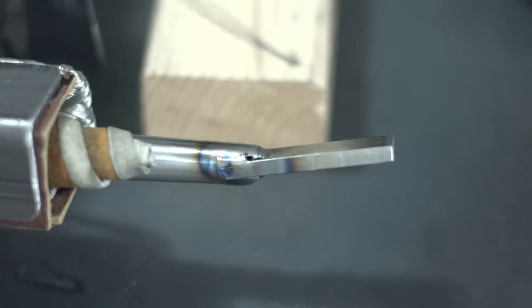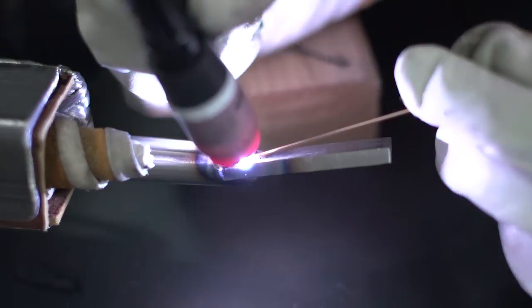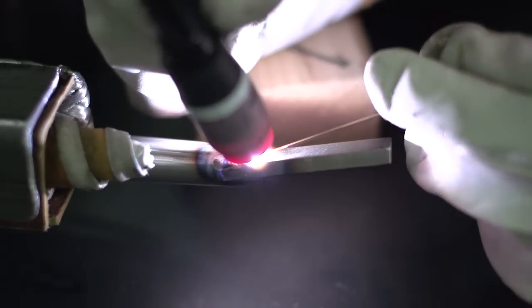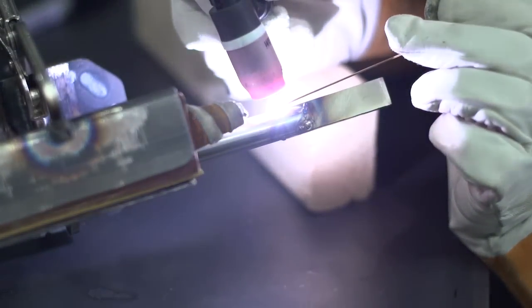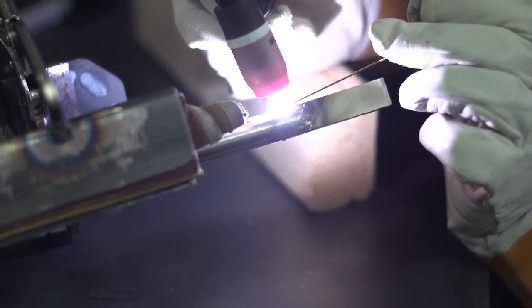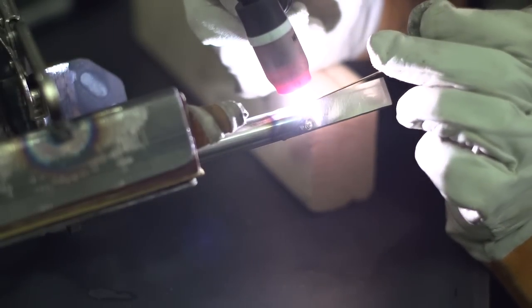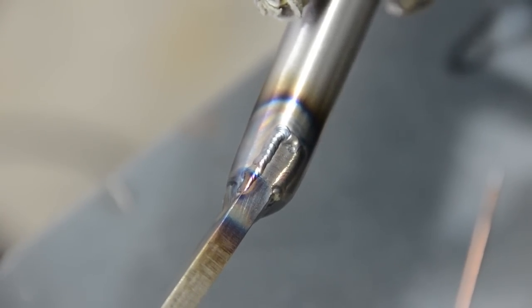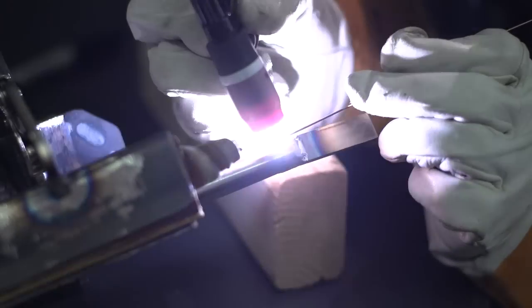There's a little hole there — I know how that happened. It was because I sanded it down too much; there was barely any material right there. So I'm filling it. So ugly. On the other side I switched — actually not pulse dip, I switched to just straight up welding and dipping, no pulse. And of all the things I tried, I actually forgot to try high frequency pulse — I just totally forgot about that. So here I am pulse dipping again. And I think that's it. We're done. There it is.